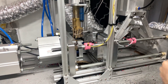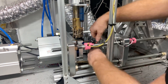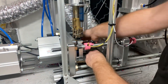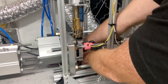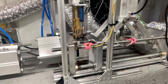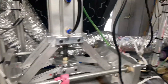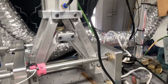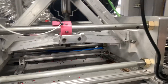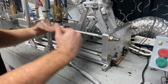We'll get the rest of the fasteners in and do a little verification. The clamp is not coming down all the way because this mold's a little bit thicker, and that right there will cause the mold to flash out. So we're going to go into adjusting this to be nice and parallel when it's down.